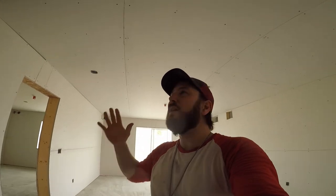One of the things I wanted to recommend when you're first drywalling a double-layer ceiling like this — this is double-layer 5/8, a lot of this drywall is 5/8. What I did with this ceiling is I figured out the layout: I did the whole first layer, then realized on the second layer I could eliminate two joints. The ceiling turned out gorgeous, really well.